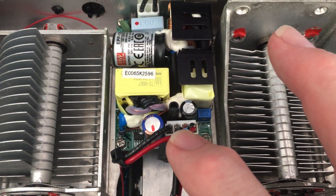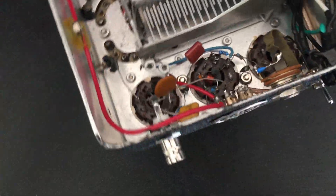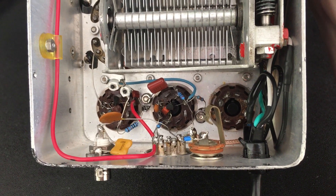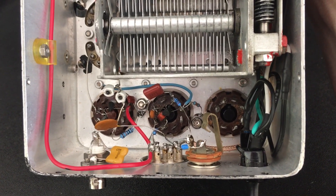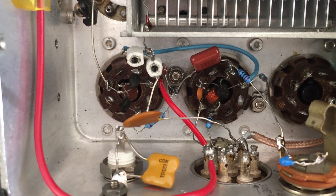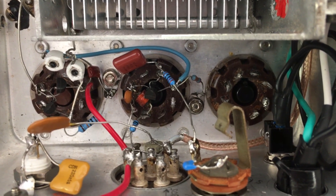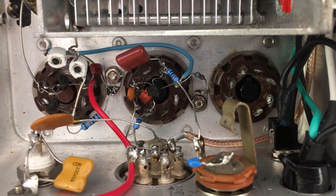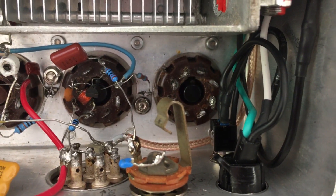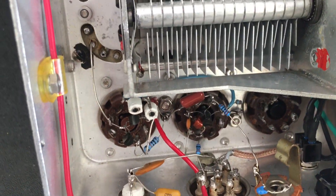Here is the oscillator in the back. The tube all the way at the left was the master oscillator tube of Hartley design, and I maintained that design — you can see it as a two-transistor cascoded oscillator. The next socket over, which was the crystal socket, I'm using that for the buffer amplifier. We feed from the oscillator into the buffer amplifier, and this socket over here is not being used for anything.